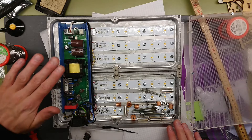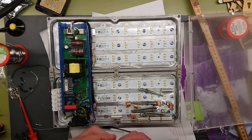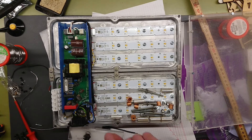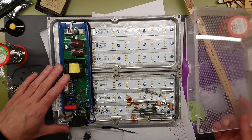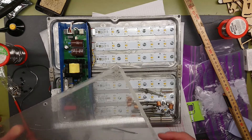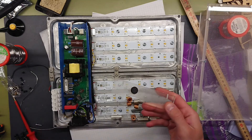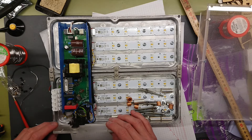To get the correct distance for the transformer to be underneath the acrylic piece, I picked up two different steel resonators from filters from base station amplifiers along with some long screws, but that gave me quite a big distance around the edge where the mains voltage is present. So I had to cut out additional pieces from the acrylic here, just made some M3 threads into it to mount the sides, and I also added a little fuse holder just for safety's sake.